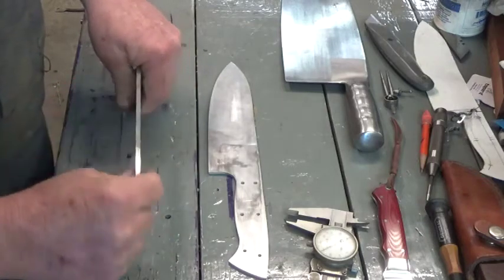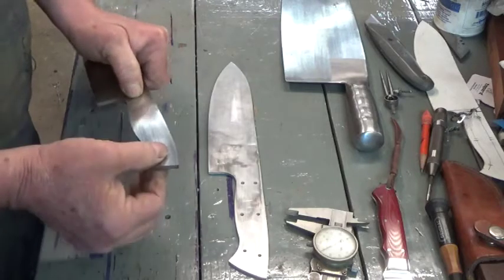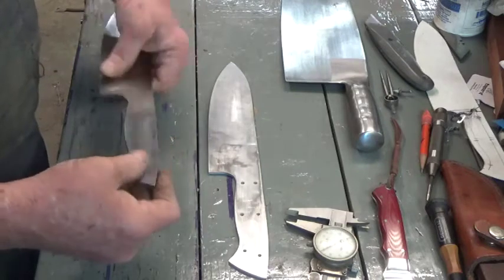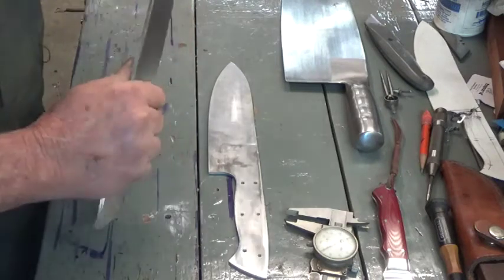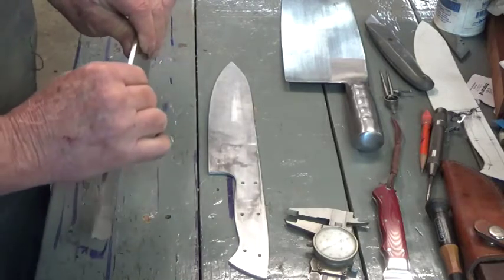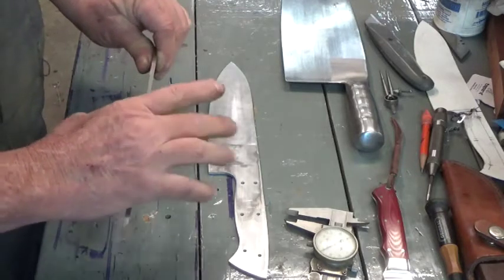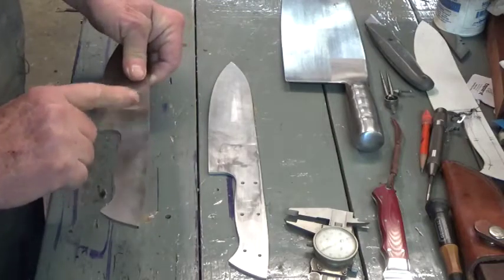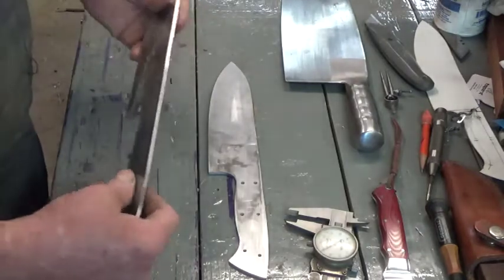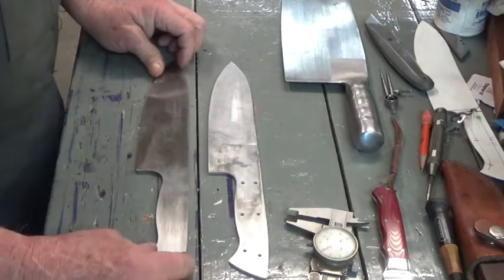Because of that weight loss, I decided I'm going to put a taper on this tang starting up here where the front of the handle is, tapering back to maybe a third of its original thickness. I think it's going to add to the looks and balance of the knife. The heaviest section of the blade is going to be right here where we stay at around 150 thousandths thickness - we may lose a little when I profile down to finish polish, but right now this is a heavy blank that won't stay that way.